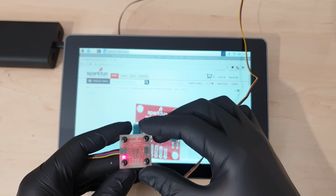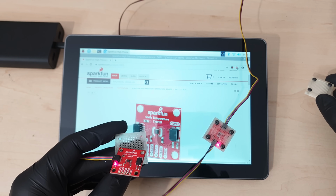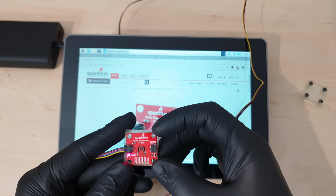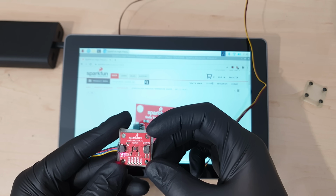I also added periodic reading of two TMP117 I2C temperature sensors to my software. With their 8 millikelvin resolution, those are just the right kind of overkill for ambient temperature measurements during long-term experiments. Remember, this is how I used to document these long processes, just a GoPro in time-lapse mode. Primitive and hard to evaluate.